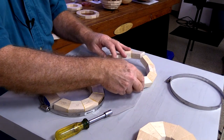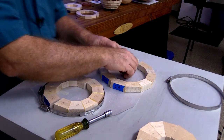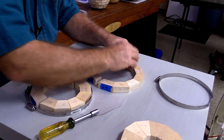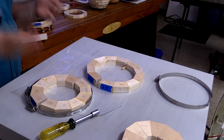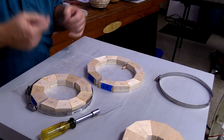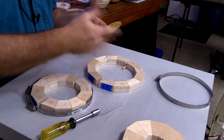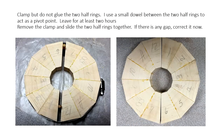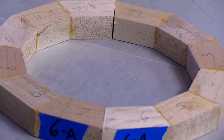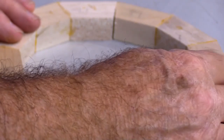Since there's no glue on the joining joints, they come apart pretty easily. The reason for having the dowels in between is this: my cutting is somewhat inaccurate and my sled is a little bit off — it may only be off one tenth of a degree, but you multiply that times twelve and you're off more than one degree. More than one degree makes a lot of difference when you're gluing up these segments. You want the segments to fit nice and snug, because that gap right there — glue is not going to fill that up.